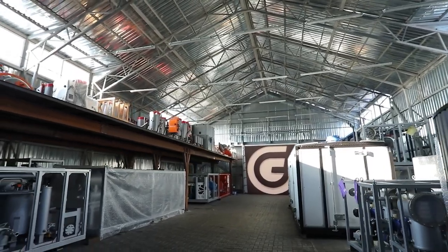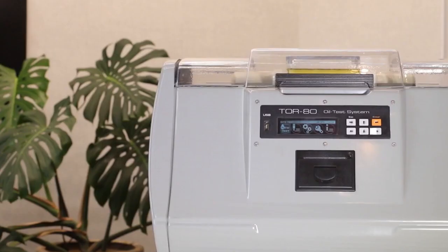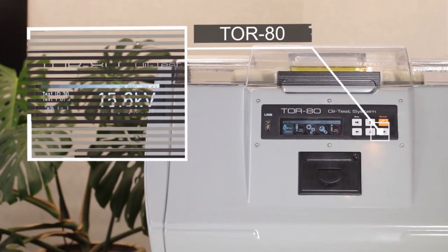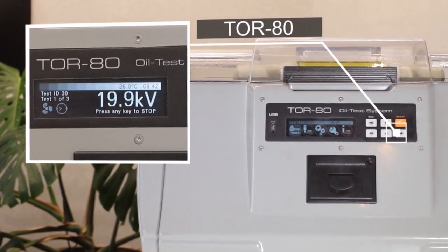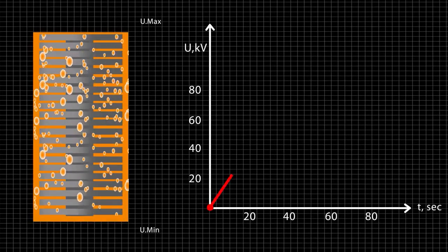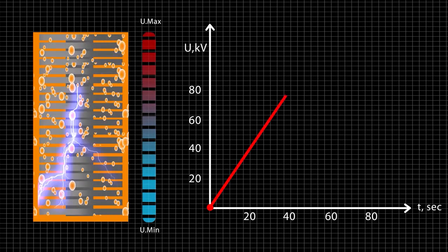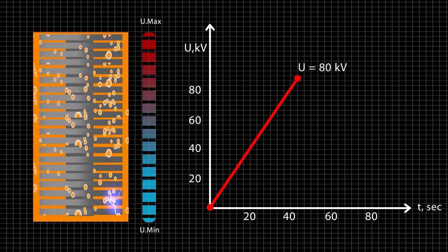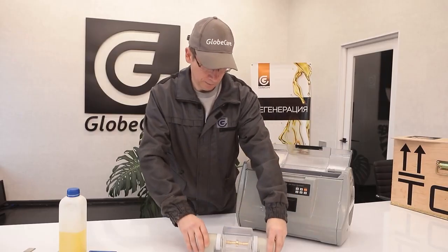Here is the TOR80 device for measuring the electric breakdown voltage. It operates by gradually rising voltage on the secondary winding of a high voltage transformer from zero to a maximum value, or to a value at which a dielectric breakdown occurs. The high voltage cutout time after breakdown is less than four microseconds — in this, TOR80 surpasses all similar devices in existence.